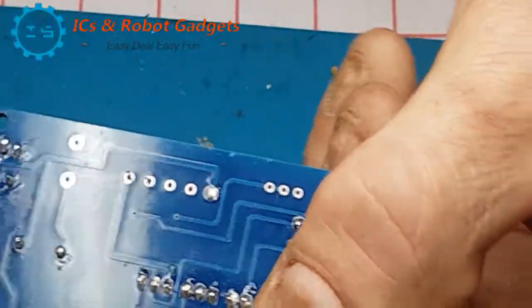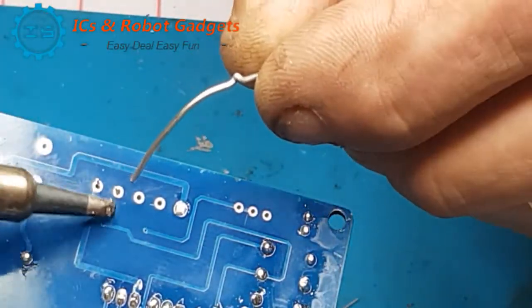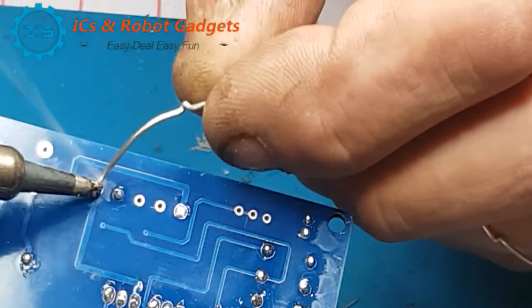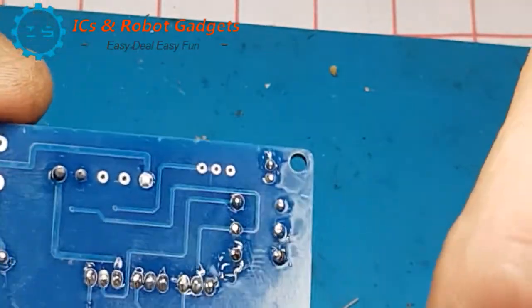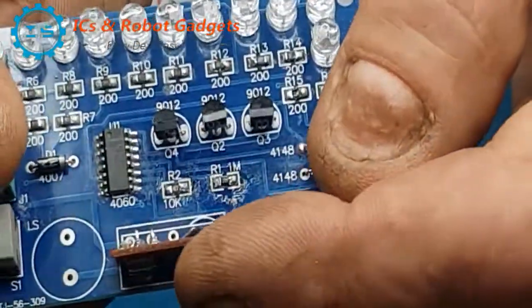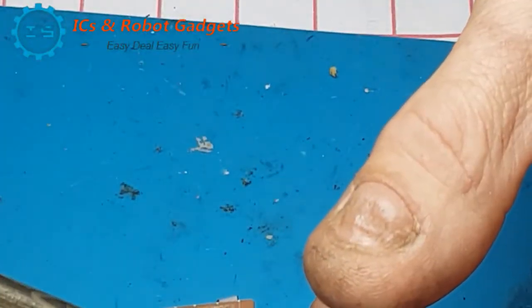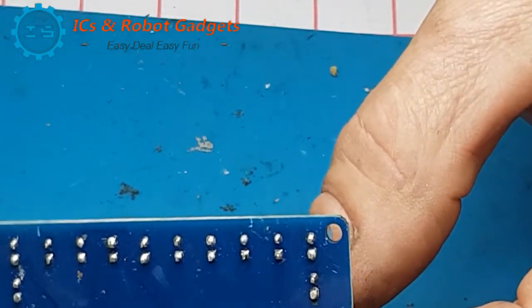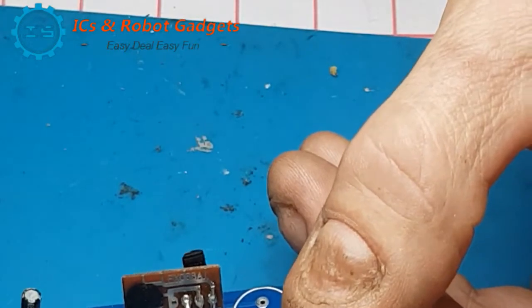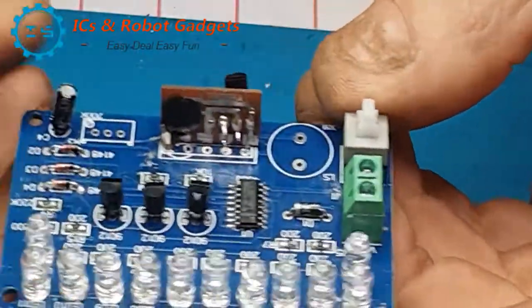So if they gave you a picture of the finished board upside down, you could see what's been soldered in there and what hasn't. You can see the solder ran through on that first one. So that appears, from what I can see in the picture, to be correct. Ooh, careful. I better just reflow that, just to be sure. There we go. Nicely does it. So yeah, in the picture, those two, I'll show you the original picture as well. Those two don't appear to be connected into anything, these two here.